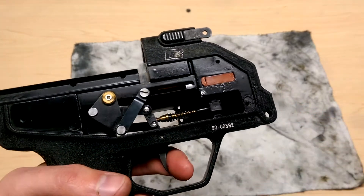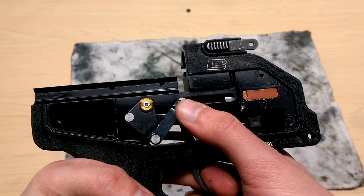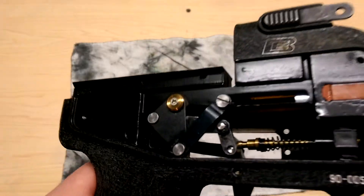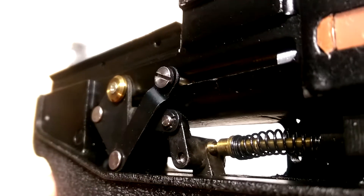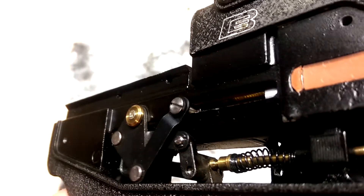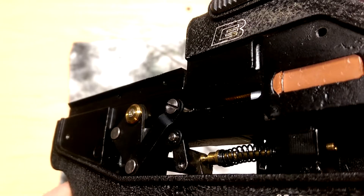Now I think this is probably the spot where they could have used some improvement. It's also possible there are missing pieces or the design changed. But this right here can bind up a little bit — it's not a really big deal. There's a little bit of play in this mechanism. You can see all this wobbling around. The screws are tight, everything's in place, but the guide is a bit wider than the screw that it rides along.